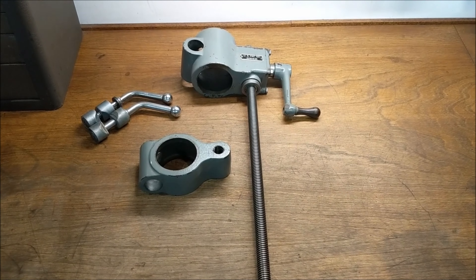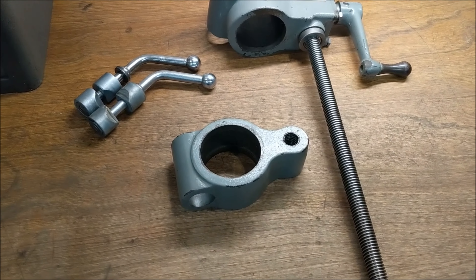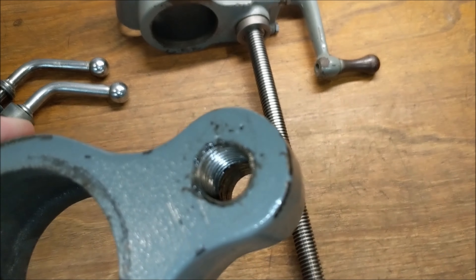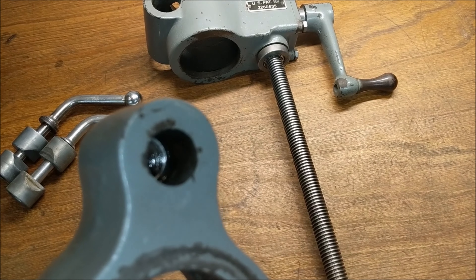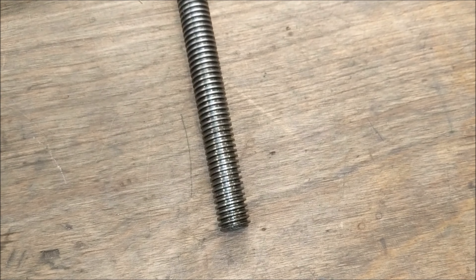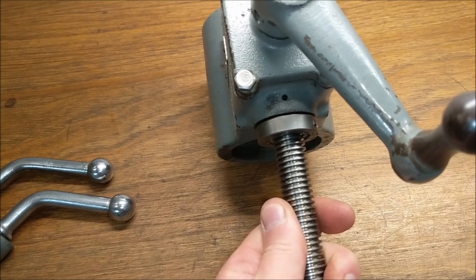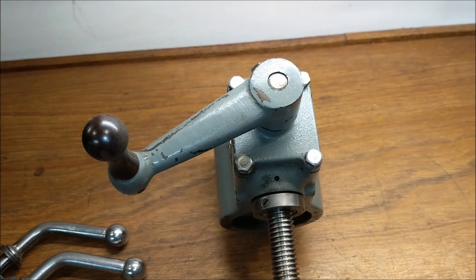Here is my backup lift. The darker one is on my drill press. Here you can see the lower collar. Note inside here that only half this shaft is threaded and the other half is smooth. I have always mounted it on the column with the threaded side up. Acme threads — just a solid piece of American made steel. Turning the threaded rod moves the gears inside, as you can see the handle rotate.